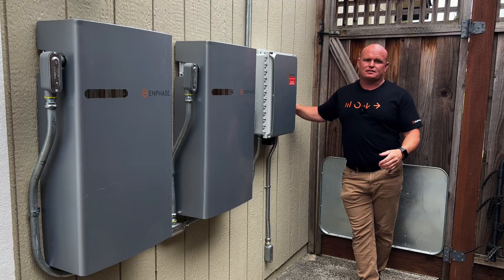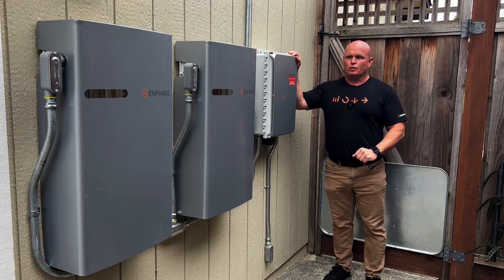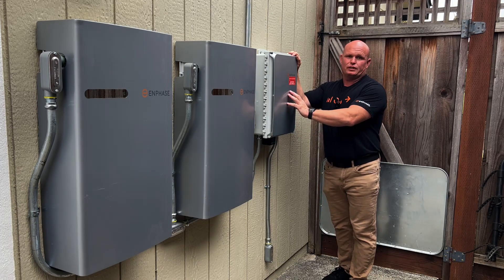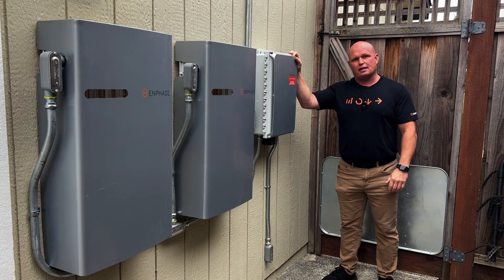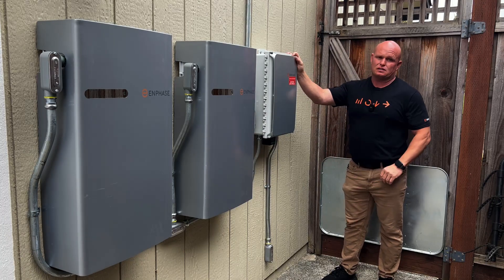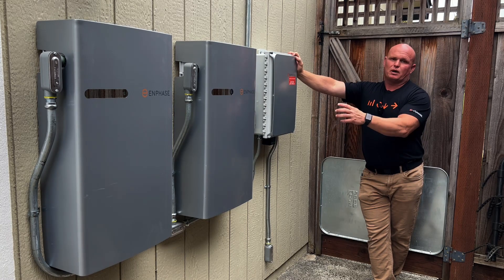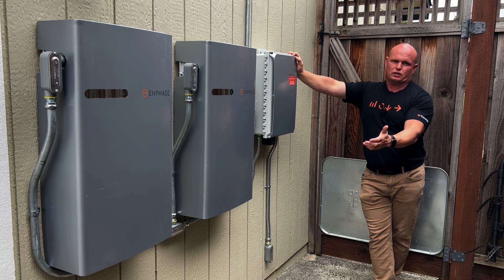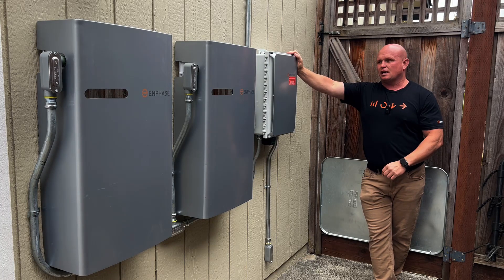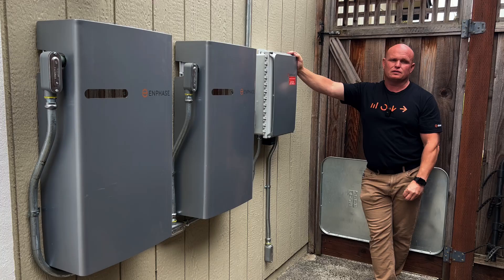One of the exciting things about this system is it has solar, battery storage, and the EV charger installed. We can see here we have our gateway — this is a unique situation where it has both the solar and the storage all connected to it because it is underneath 80 amps and is fed into the main panel, so it's just a very fast and easy connection. The gateway inside is connected to those consumption CTs and is monitoring and communicating with all of the devices within the ecostructure. The IQ EV charger in the garage is communicating to the gateway through the cloud, which helps coordinate the charging with any available excess solar.